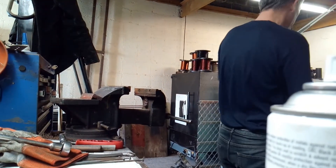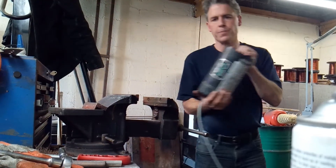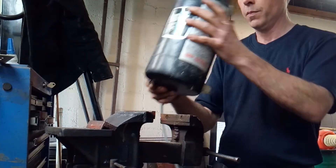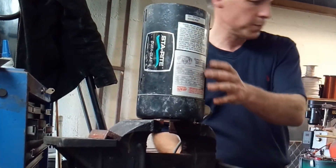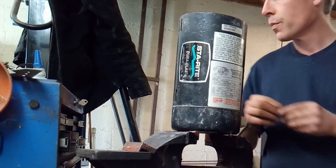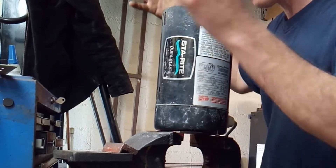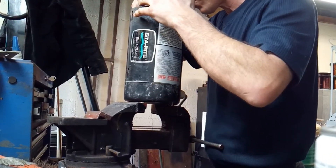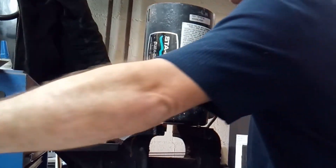Right then, this is the part where we get to put the pump back together again. What I've done here is I've put the back cover back on so that we can sit it vertical while we put the rotor in. This way we make sure we don't lose this wave washer. You can do it horizontally but you just run the risk of it falling into the windings, so I prefer to play it safe.